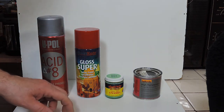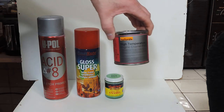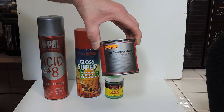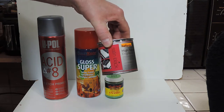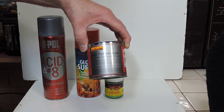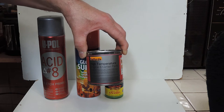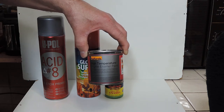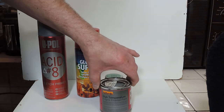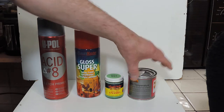The firebox we treat very differently. I've tried various different things over the years — barbecue paint — but in the end I've ended up using this. This is Halfords high temperature engine enamel paint. I've got both satin black, which is what I'm using on the Mammod firebox, and matte black. This stuff is very good, it's a very thick paint, however it will level off — obviously you apply it with a brush. The way I do it on a firebox is to paint one surface and leave that horizontal, wait for it to dry, then paint the opposite horizontal surface, and so on. I generally do a couple of coats.